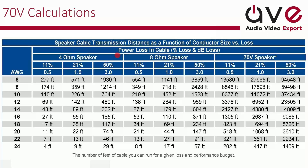This is a graphic from JBL/Harman. On a 70-volt speaker using 16-gauge cable, you can go a full 9,000 feet and only lose 3 dB. That is phenomenal. You don't have to worry about huge line losses in these kinds of applications — it just doesn't matter. So when you're going 70 volts, you can go really long distances. 3 dB is not a lot; it's not a big deal.